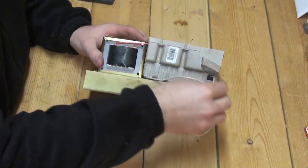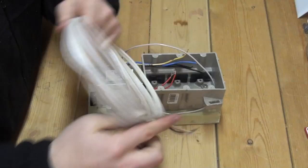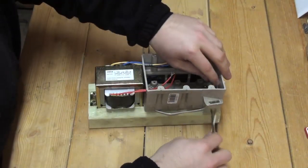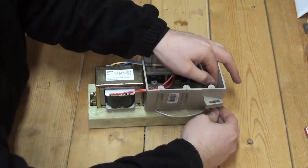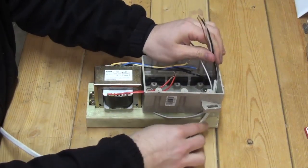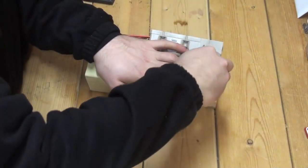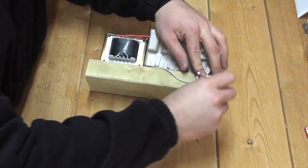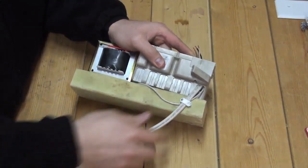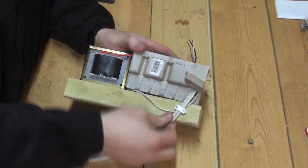Take the ground wire and feed it through the service hole, then pass the main service wire. Inside of the electrical box, around 4 to 6 inches of service wire should be sufficient, but you can always trim the excess if you want to include more. Then, using cable staples, secure the service and ground wire to the wooden block. Make sure the wires are snug, but a second staple should be placed to act as a backup.